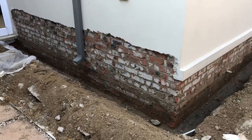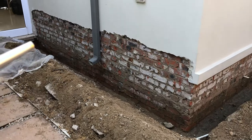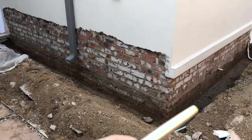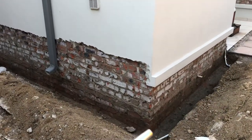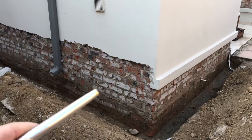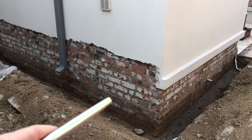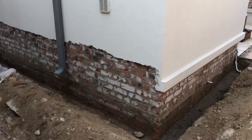Hello and good day to you, welcome to another video with Future Interiors. Today we're damp proofing by removing soil in a trench. As you can see, we've gone roughly three bricks below ground level, and this is the damp proof course that you can see running — where the water is very saturated below that and above it is much drier.